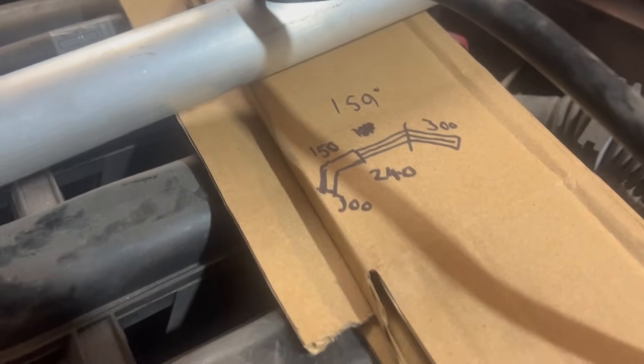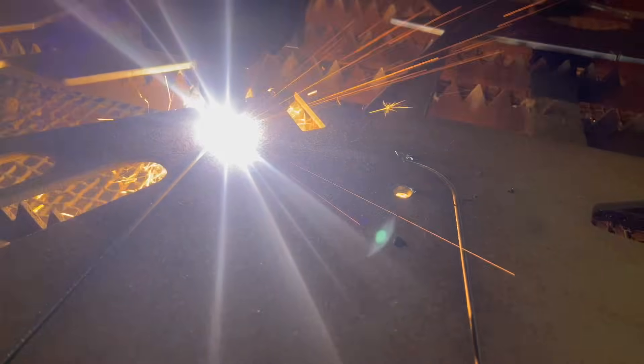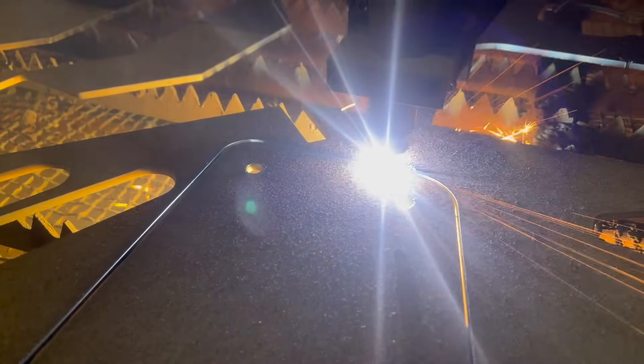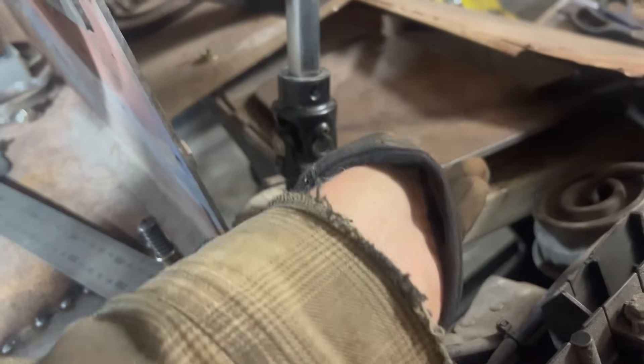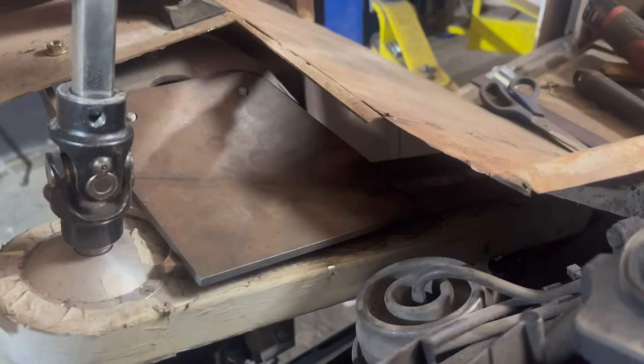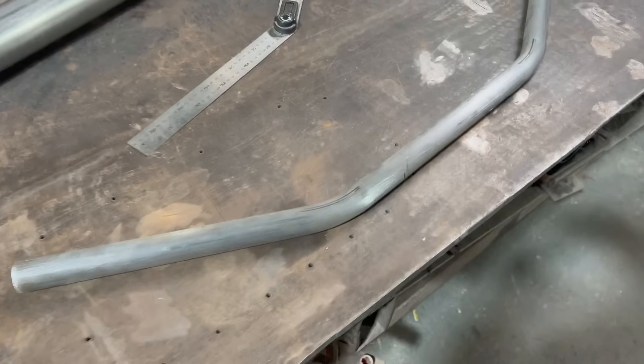Here we are on Fusion 360, the software I'm now using for all my CAD and CAM output. This is a simulation of the tool path on the plasma — great because it shows exactly what's going to happen when we move over to the table. Cutting out the actual part now — this is 5mm mild steel — and look at that, absolutely amazing. A little fold through there to give it a bit of angle, sitting perfectly. Bending up the tube now and joining the two — two identical bends in a bit of CDS.